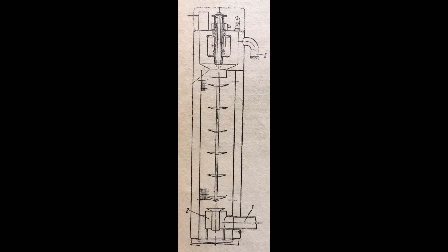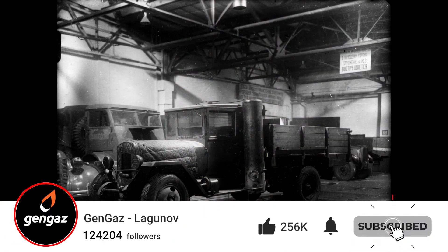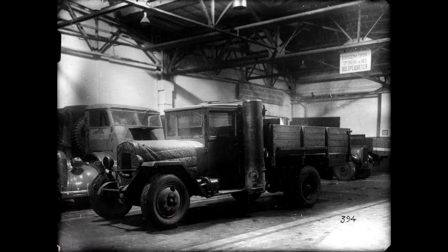In the last part, I showed the first electric filter for a wood-powered car in the USSR by Comrade Tidov, designed for the charcoal-powered ZIS-31. Amazingly, the engineers managed to make a filter that cleaned as much as 60 cubic meters of gas per hour while consuming only 20 to 25 watts.